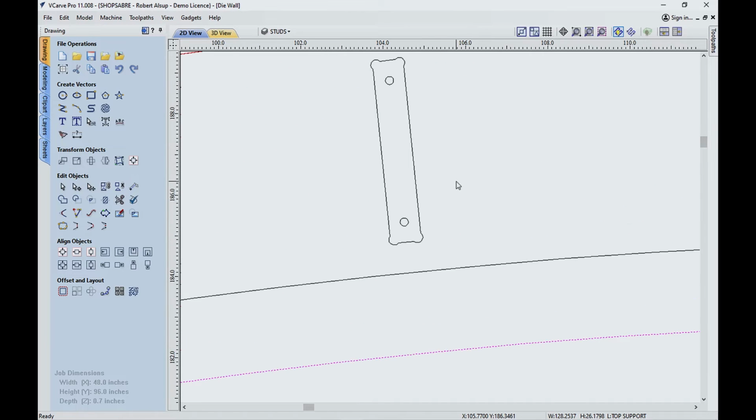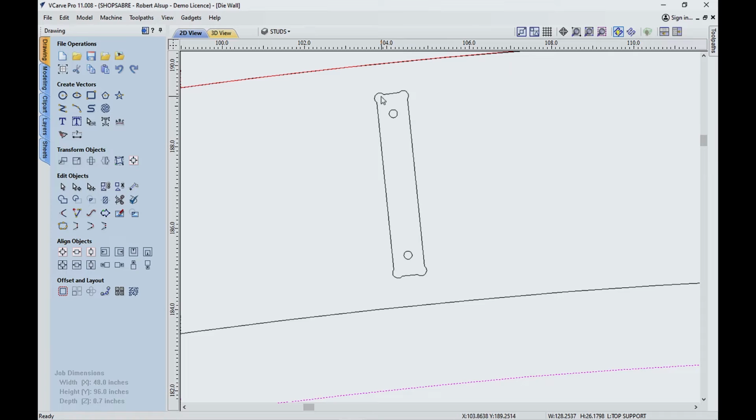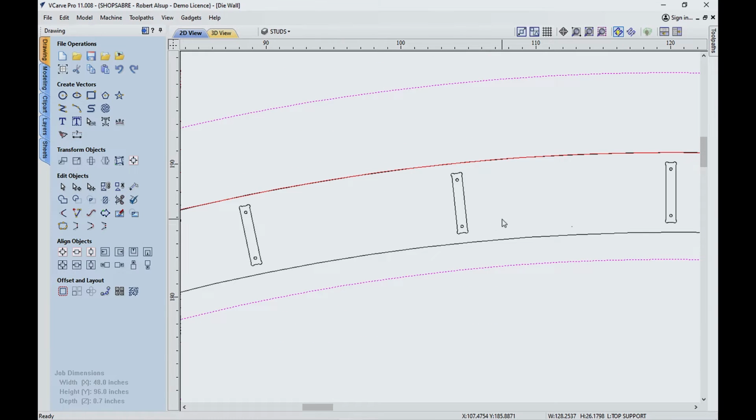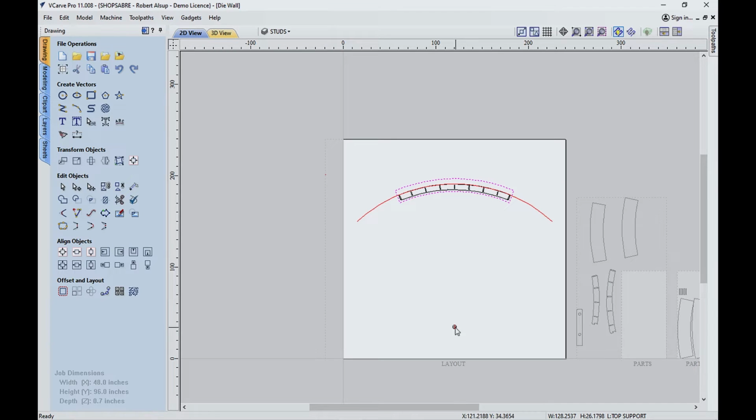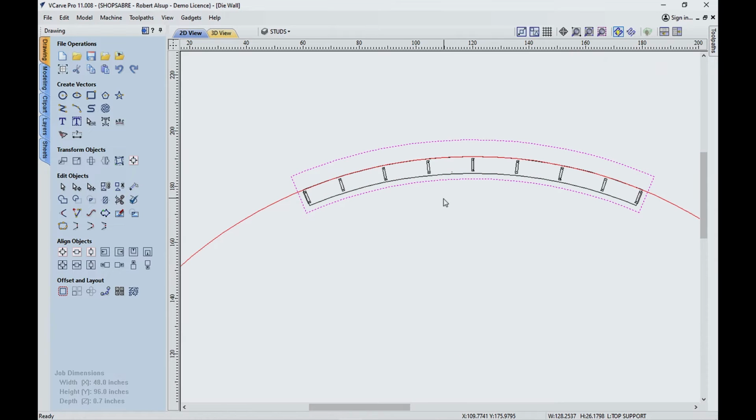If you notice, what I did here was I used dog bones. Here's why: if you use dog bones, your piece that fits in here is square, so you can dial it in where it really fits well. I normally don't use dog bones if it's viewable, but in something like this, everything's covered up in the finished job, so it works out pretty good. I put these holes in there so we can screw it together. And if you drew a line from here out there, you see everything's angled towards that center. So that works out pretty good.